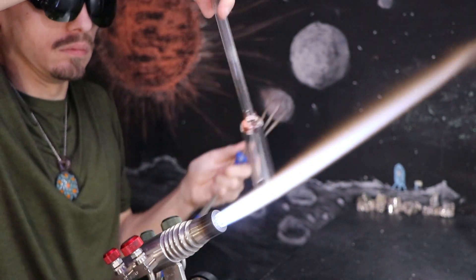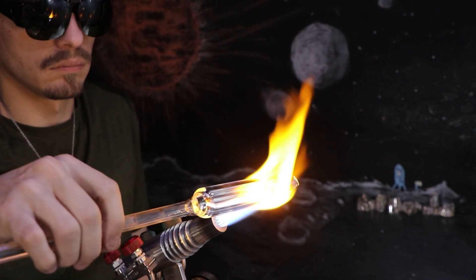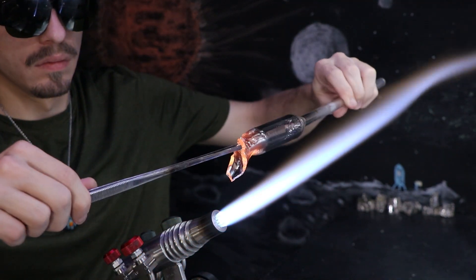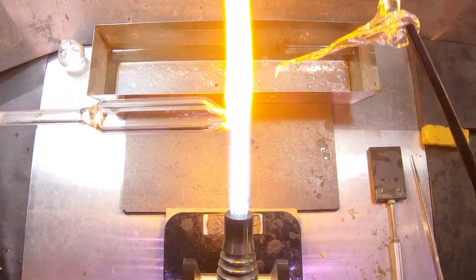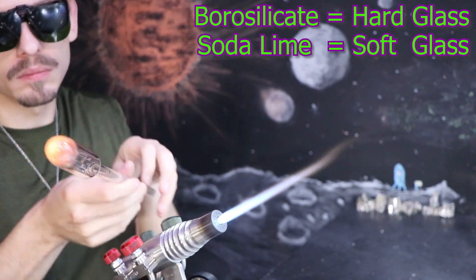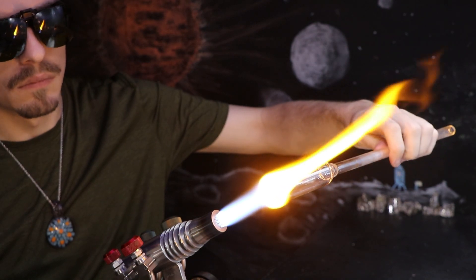I'll keep it as level and straight as I can as it's cooling and sets up. It's kind of difficult with these claw grabbers. Then I'll heat up the end to remove a little bit of that broken section while also closing it up so I can pop a hole to attach another tube. I'm not quite sure how well glass will work — for every example I've seen, they used a metal container. But it's good to note that borosilicate is a lot different than normal soda-lime drinking glass; it can withstand about three times more thermal stress, so it's often used in laboratory conditions. I wouldn't try this experiment with a normal drinking glass.